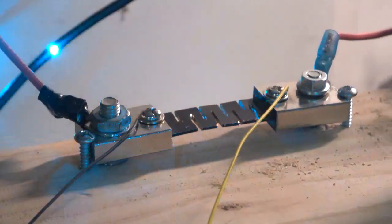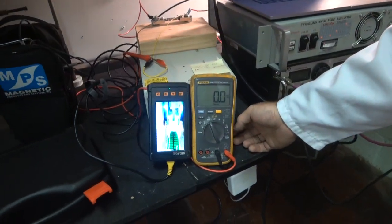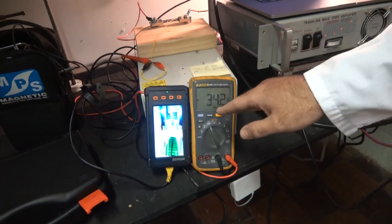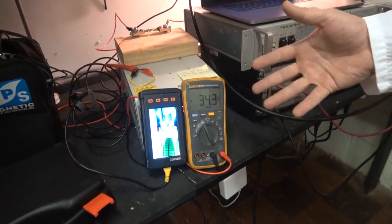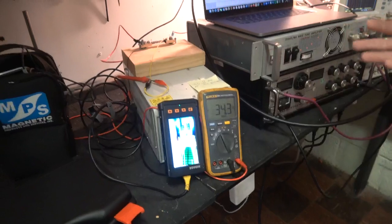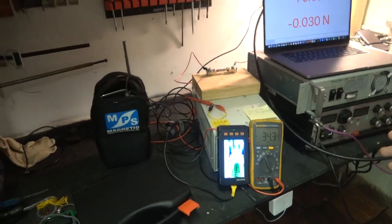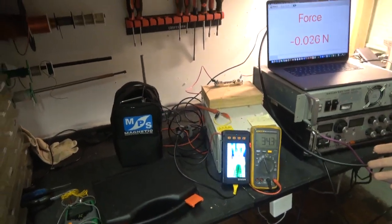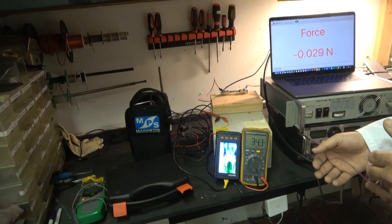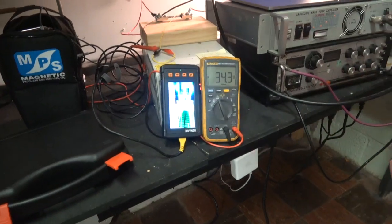The shunt that we added to the circuit gives us a much more accurate reading on exactly what's going on. We had to chop it away to give us a higher resistance reading, and as we power up the power supply for the electromagnet, you can see we're reading 34.2 millivolts on the shunt. That gives us a much more accurate reading as to what is going on on that electromagnet. In this case, the current doesn't matter all that much — we just need to make sure it's extremely stable. So we calibrated against another Fluke multimeter: 50 millivolts at 10 amps, and simply sliced away until we got to that point. It's pretty thermally stable. We're just monitoring the current of the output from the power supply to make sure that it does not drift around, because it needs to be really stable or the results won't be verifiable.